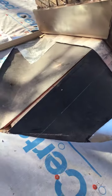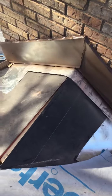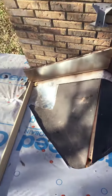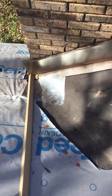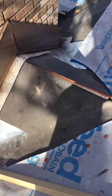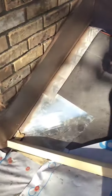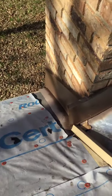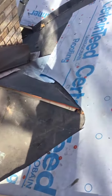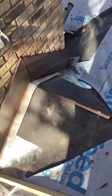The customer had no idea that this was even happening. We're going to always do the roof right and do it correctly. This is how it's done the right way. You can go out and check behind your chimney now and see if you have one of these crickets. This will all be shingled up when we're done. If you don't have one, be sure you get one next time you have your roof done, just to avoid any future problems.